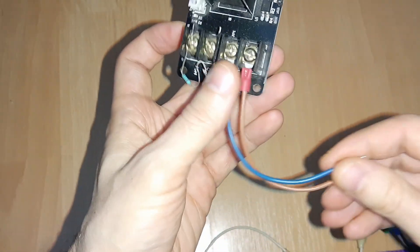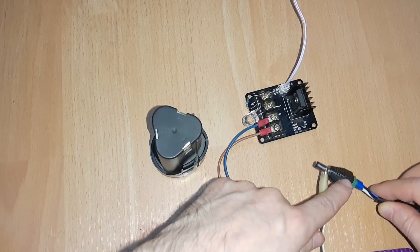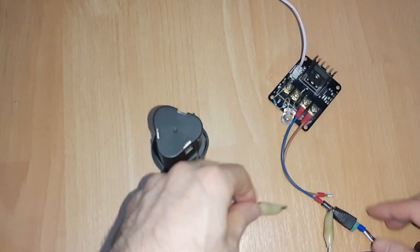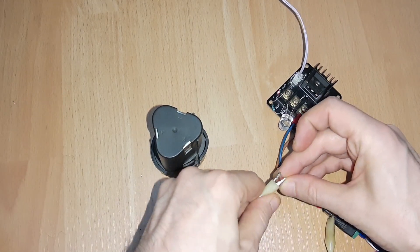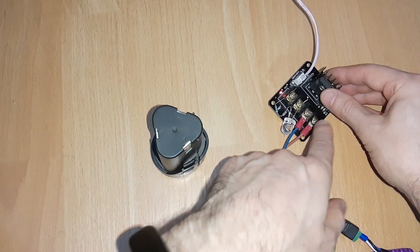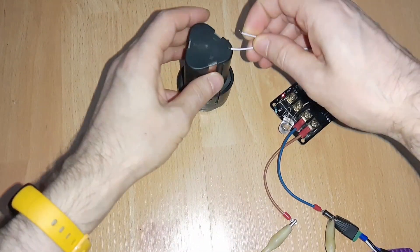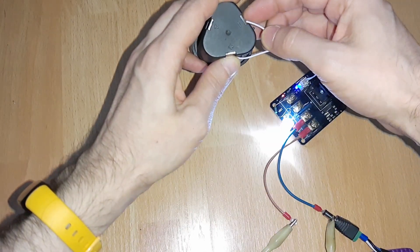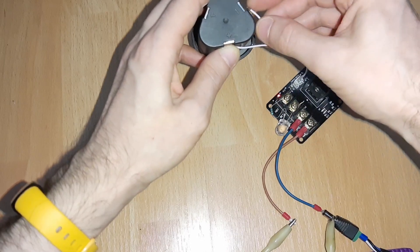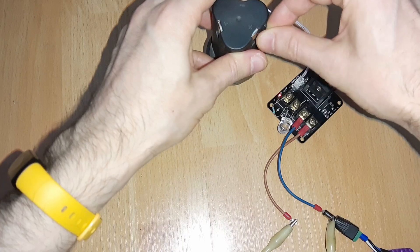Normally this module is made so you just connect it to the output of your motherboard, connect the wires to the power supply, and the bed. Now let me make a demonstration. This is my 24V power supply. I'll connect the plus here, and the minus to this wire. You can see it has a presence LED that shows we have power. This is plus and minus — I'll show it works both ways. The moment I put this here, there's also a presence LED, but you can see the big LED turning on.